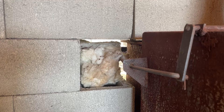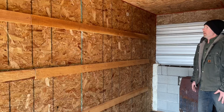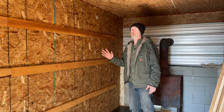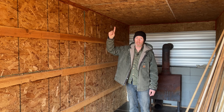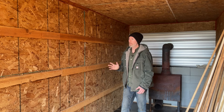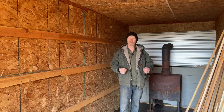This hole was for the damper control — I just stuffed a piece of insulation in there as a temporary fix that ended up being permanent. Single-wall stovepipe inside, then double-walled going through the wall — everything in that hole is heat-resistant. The walls are two-by-six studs on 24-inch centers with six-inch batt insulation between walls and in the roof. The studs to build this were the first lumber I cut on my mill. This was early 2021 when OSB prices shot up to ridiculous levels. Just a year or two before I had torn apart a shed made of OSB and almost threw all those sheets away, thinking they were only six to eight dollars a sheet. When it came time to build this I was so glad I kept them, instead of paying eighty dollars a sheet.